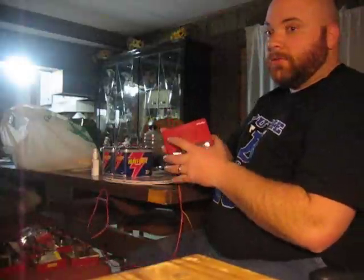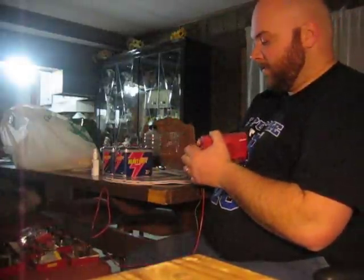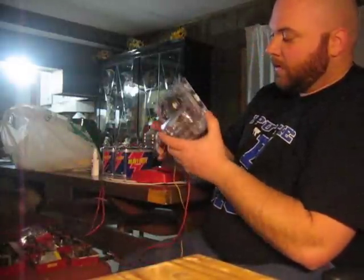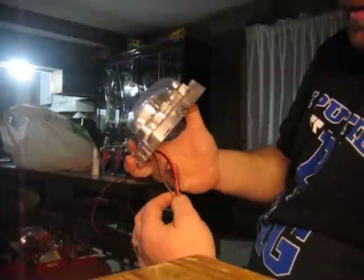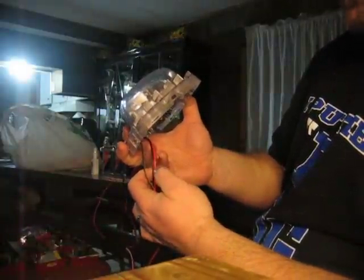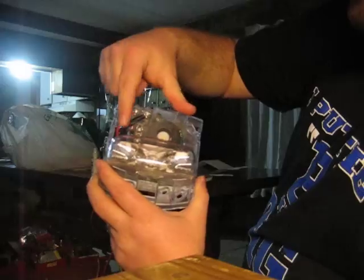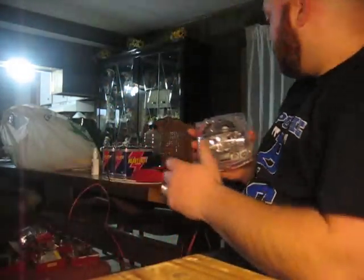This is a four-wire true alert. There are four different terminals — two for the horn and two for the strobe. I'm only running three wires to it: the black one being the ground, the brown one being the hot for the strobe, and the red one being the hot for the horn. Makes it a little easier on me, a little less clutter.